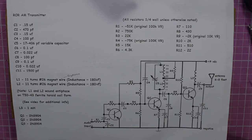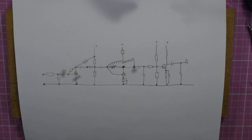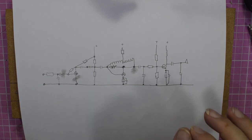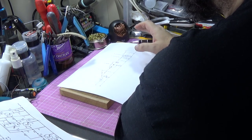I could breadboard it, but let's old-school breadboard it — you'll see what I mean in a minute. I took the schematic and translated it into a linear layout. From the raw schematic, I started at one end — the input, where the audio comes in — and drew the components in line as they connect. This technique works for everything from transmitters, receivers, amplifiers, guitar amplifiers. It's effectively making a point-to-point wiring diagram of where things physically go.